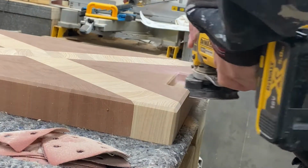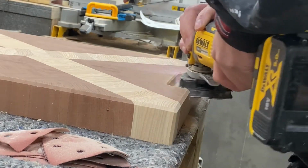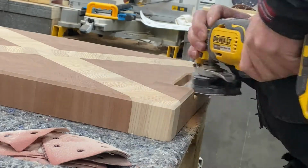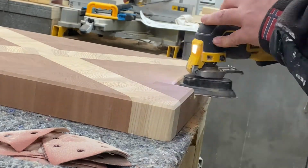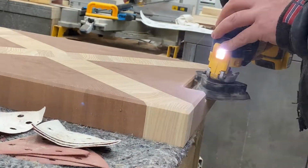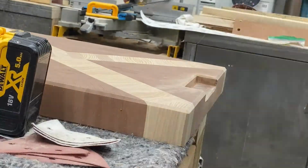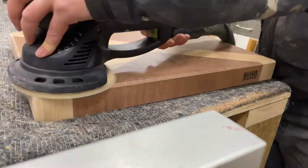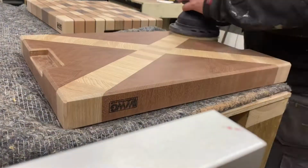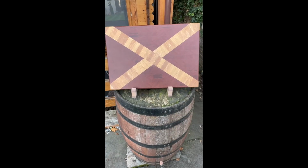Here you can see me using a multi-tool for sanding the handles. I found that really quite difficult to manoeuvre, so I've since bought a Festool RTS 400, which is much better for doing the handles. Thoroughly recommend it, although I wouldn't recommend it for the surfaces. The Rotex RO 150 pictured here is a much better sander for getting a smooth flat finish.